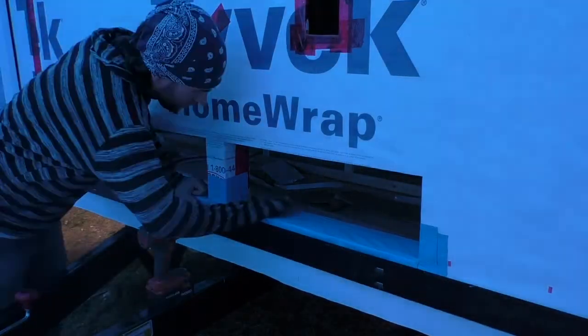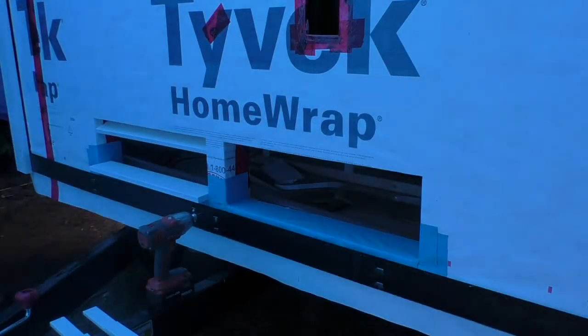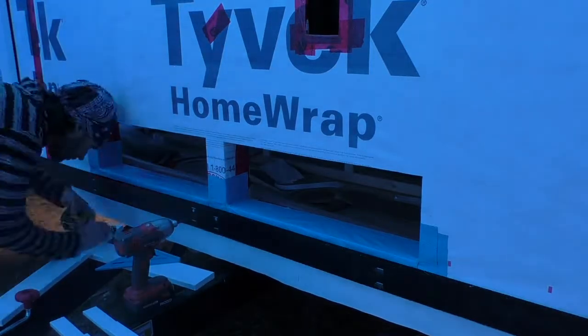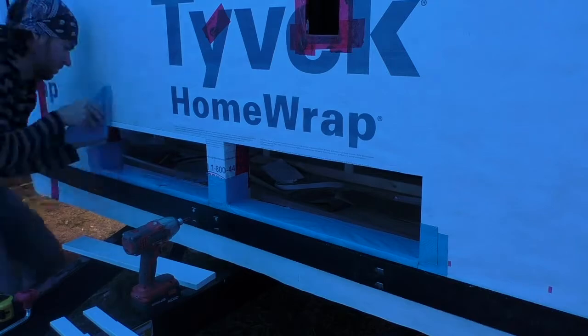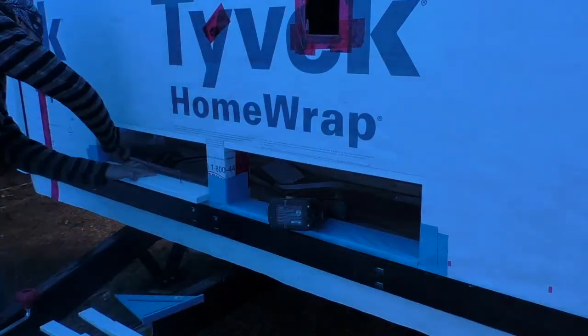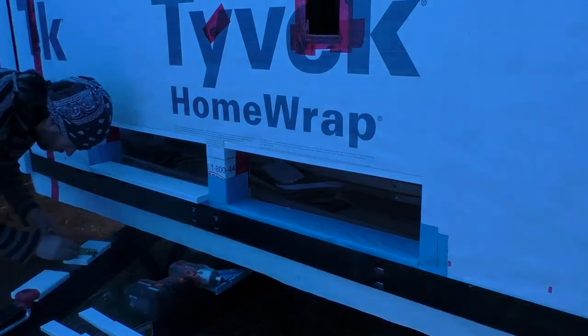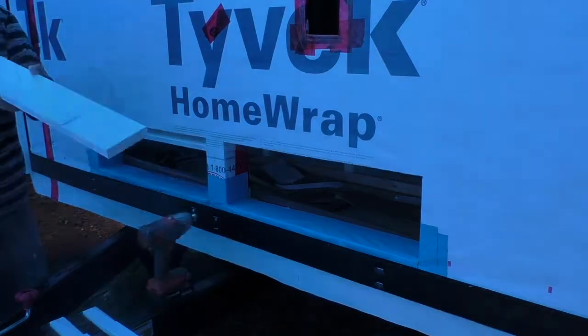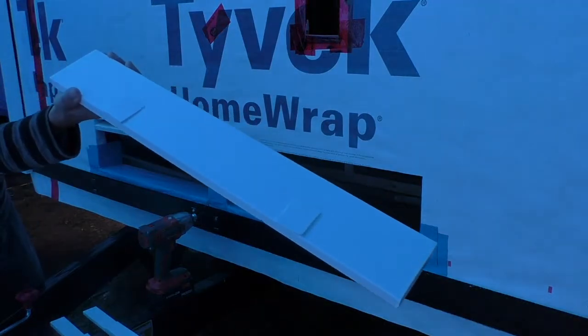Let's dive into that. I needed something for the storage doors to attach to, and it needed to be weather resistant. The simple solution was to reverse engineer the jamb that came with the main door. I used 1x4s and simply framed it in, but I stuck the bottom ledge out to create a bit of a sill, and used shims underneath to angle it so that the water would fall away from the house. It's a little hard to see the shims, but there they are, painted along with the rest of the board.